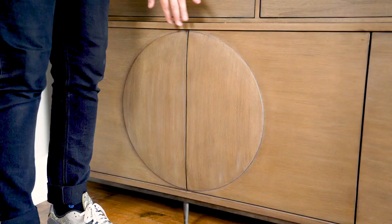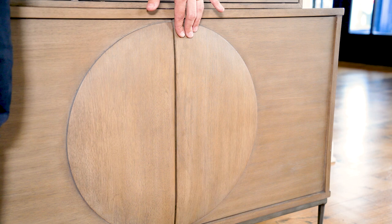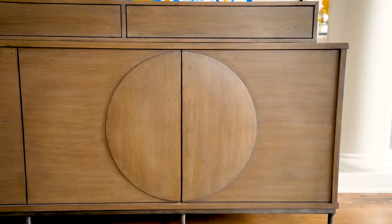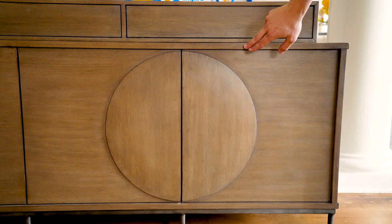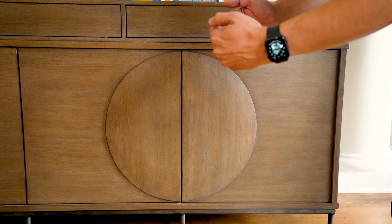We've already adjusted these hinges, so these doors are opening properly like they should. Since we've leveled the cabinet, this door is now sticking and not working properly. So now we'll show you how to adjust those hinges so it doesn't rub on either the top or the bottom rail of the cabinet. Keep in mind that each door was meant to have a sixteenth-of-an-inch gap all the way around it, and right here you'll have about an eighth-of-an-inch gap because of the two doors. You want this gap to be very uniform — that will stop each door from rubbing together.